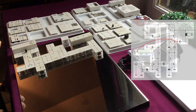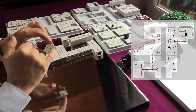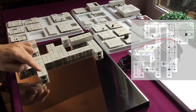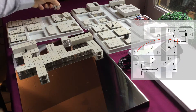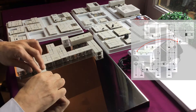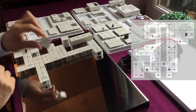To connect the capacitor to the second transistor, we first use a cross block. This cross block has 4 connections and each connection is connected with each other. We place it here. Now we are going to use the second transistor — it's also an NPN transistor, with a base, emitter, and collector. We put it here, and we also need to ground the emitter of this transistor using a ground block.